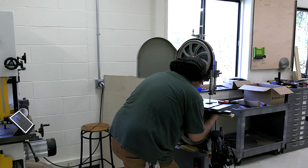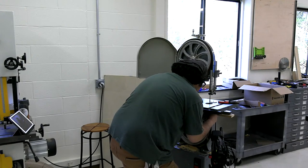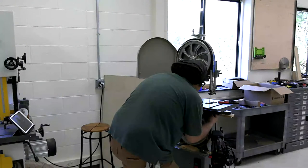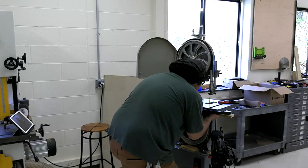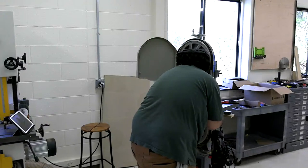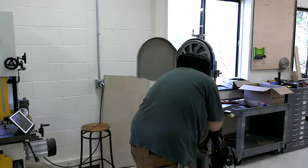Bottom guides, they get dialed in once and then forgotten about, and this is why. All right, so the bottom, I have a tendency of setting them a little looser. I'm just going to be within a shy 16th of an inch, because I really just want to make sure that they're not hitting unnecessarily. And I'll really show you where I set them on the top bearings because you'll be able to see it. I'm not going to be able to get a good shot for you here.